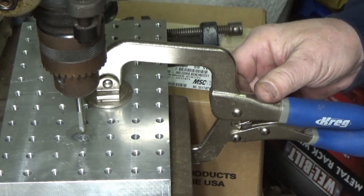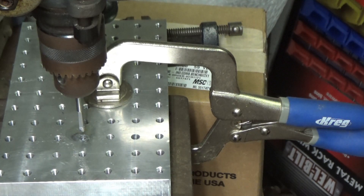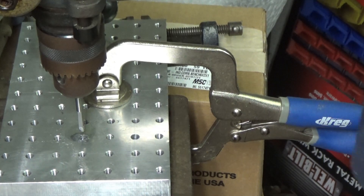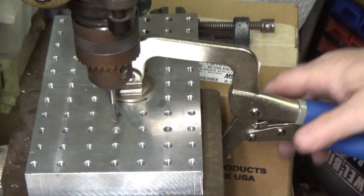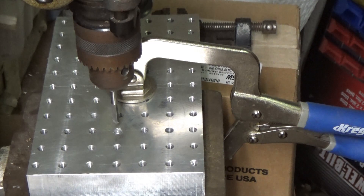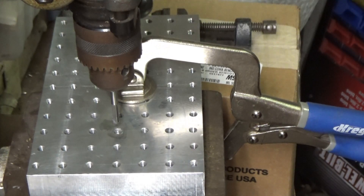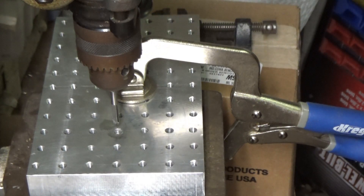It's drilling, but it's going a little bit off-center. I think I'm going to take it back over and hit it with the diamond burr to try and pull it back on center again. The problem is that the tap actually broke and shattered inside, so I've got some interrupted cuts. I used the diamond burr and flattened it out pretty good, so essentially I'm starting over with my drill. I might have to go through this a few times.